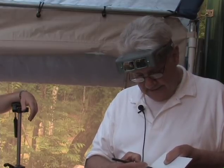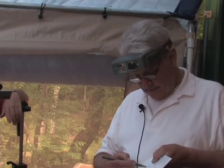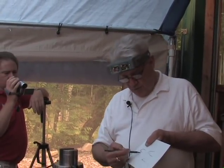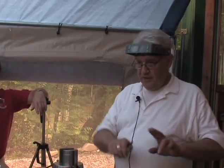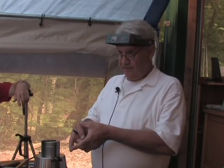The third method, and I've used all of these, is actually the easiest method, and that's kind of a fish bottom thing. So it's rounded. And the way to sharpen it on a stone is you're going to be rolling it. You first hit the bottom part and get the cuts started, and then you work up the sides of the bit until you've got it into an onglet position. But I don't use a stone.